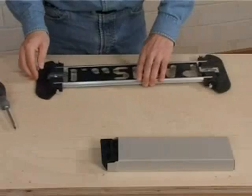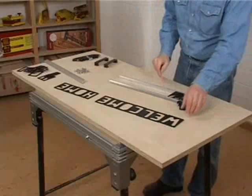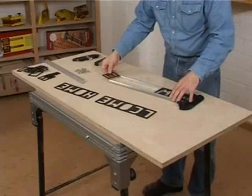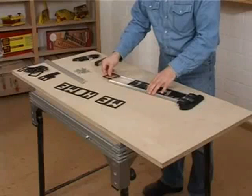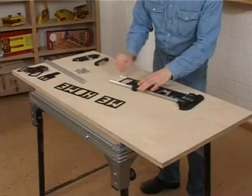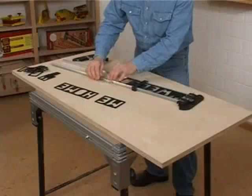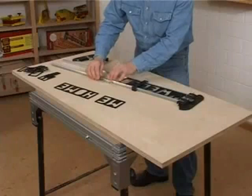For assembling signs 18 to 36 inches in length, you begin the same way. Lay out the desired templates and slide them into the rails. Be sure to use the included bridge for added stability. To attach the second set of rails, slide the rail joiners halfway onto the ends of the rail and then tighten the first set of screws. Then, insert the next set of rails and tighten the second set of screws. Continue to add the remaining templates and a second bridge.